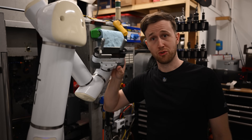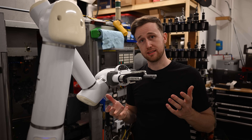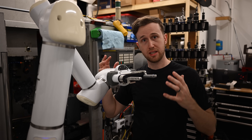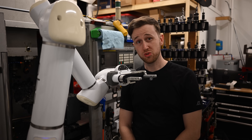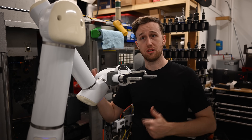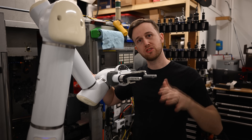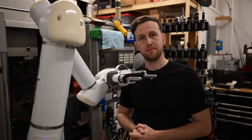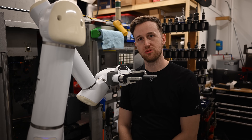The newest addition to the shop is this robot, affectionately named Flash by my wife after the sloth in Zootopia, because it's not that fast. I went to IMTS last year and talked to the folks at Productive Robotics, and realized that in order to gain some time back — this being sort of a part-time second job — I needed more capacity. I ended up finding a used one on eBay and buying it, kind of just hoping I would make it work. I've set up a pallet pool on my Sharp 2412 that is able to do what I call fake five-axis — basically two zero-point plates, one on the three-axis table and one on the fourth axis, and the robot moves the pallet from one to another. I can do slightly more complex parts that might only require a five-axis op, and right now I can do seven runs on the pallet pool, but soon it will be more than that.